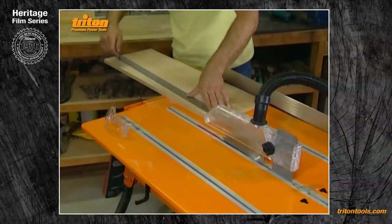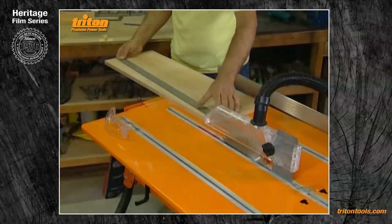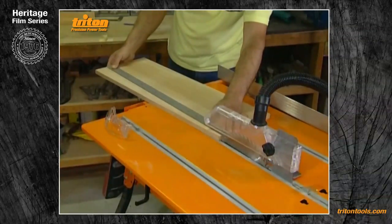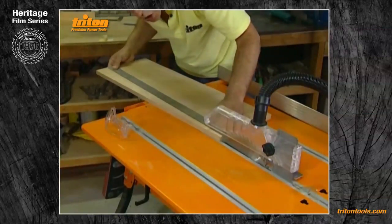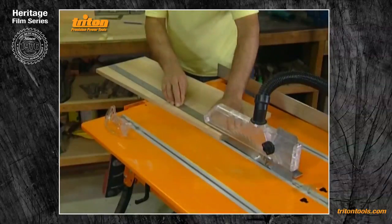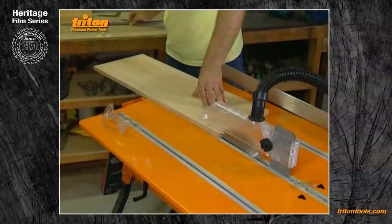Select your taper angle and then mark it. And then preferably use a long straight edge like this one or any other straight edge and gently touch it against the side of the saw blade and the overhead guard support. And when you're gently touching both of those on the left-hand side of both, double check that you're still exactly on your line, which I am. Okay, that's my position for my board. I'll try not to move that at all.